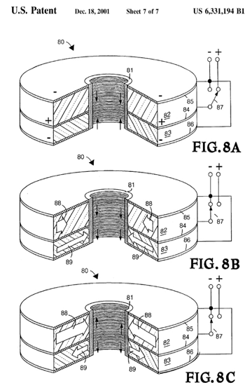Fused silica is pure transparent quartz glass, a dielectric, which is why the machine is called a dielectric wall accelerator. A sketch of one of the assembled modules of the accelerator is shown in the patent sketch. The module is about 3 cm long and the beam travels upward. The dielectric wall is seen as item number 81.